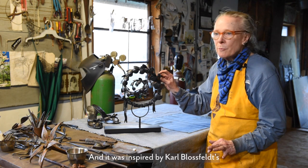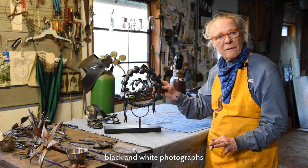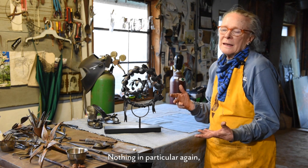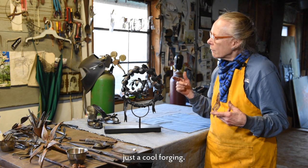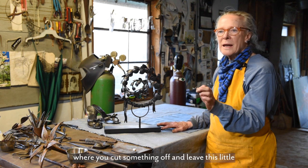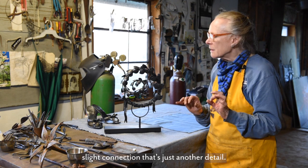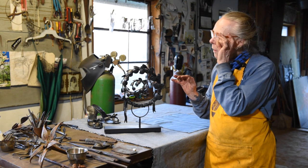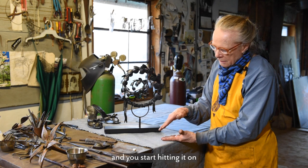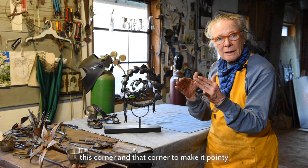It was inspired by Carl Blossfeldt's black and white photographs of plants. Nothing in particular, again, just a cool forging. I was talking about the center of those flowers, which is made where you cut something off and leave this little slight connection. That's just another little detail. When you're tapering a piece of flat stock and you start hitting it on this corner and that corner to make it pointy,